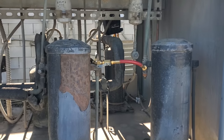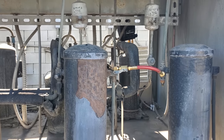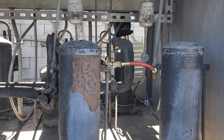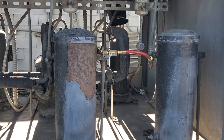Why are we doing this? Because our unit has a head pressure control valve. The head pressure control valve is there to flood the condenser in lower ambient temperatures — basically in winter. It maintains the head pressure at a higher level.